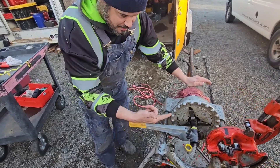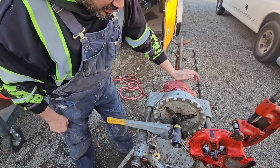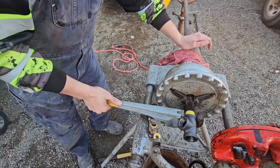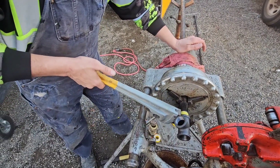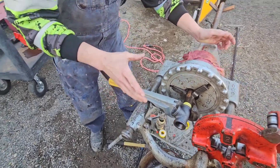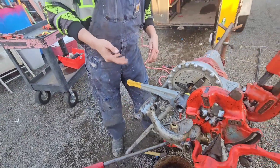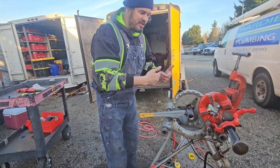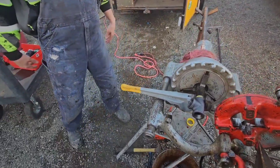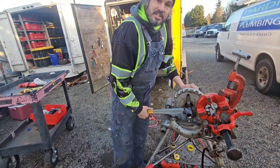Let it grab. The machine is threading into my fitting. The pipe wrench has my fitting and I can still pull up. So this is how you do it - you put it on, and when you can't easily pull up anymore, that's when you know it's done. It's a feel. I'm going to go live in action - you're going to see me bounce. When I can't bounce anymore, take your foot off the pedal, because when you take your foot off it's still spinning just a little bit, and that's what drives it finally home. Done - it got super tight, I jumped off, took my foot off the pedal, the machine kept going just a little bit, and that joint is completely made up perfect. Pull your wrench off - that thing is money.